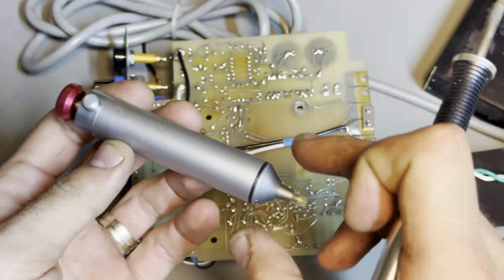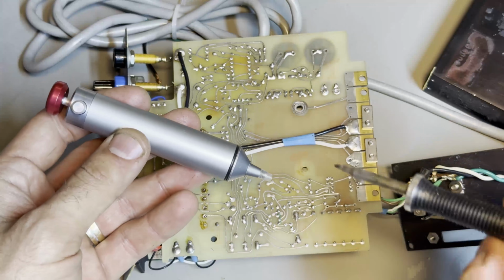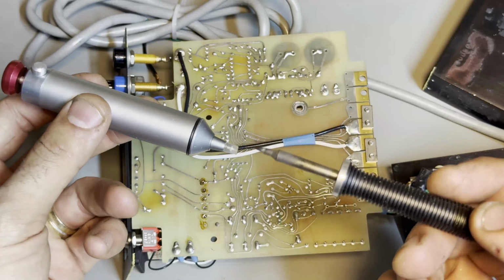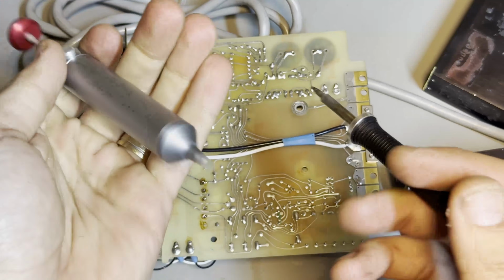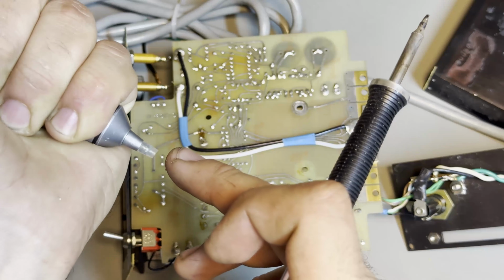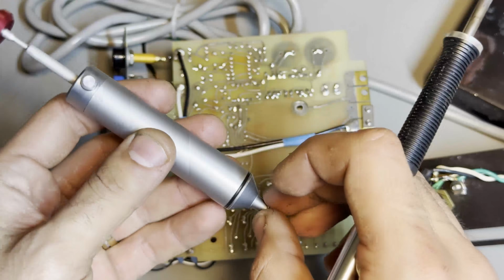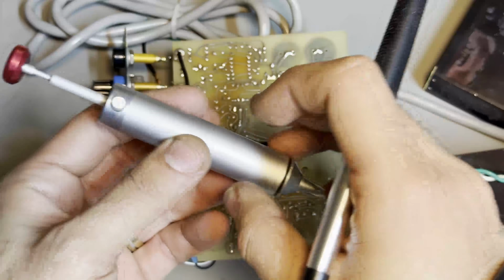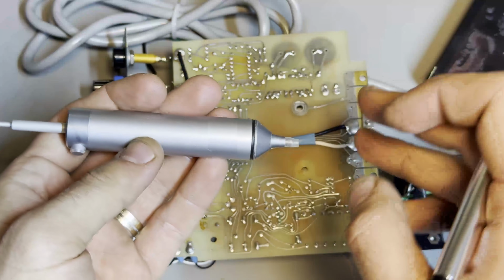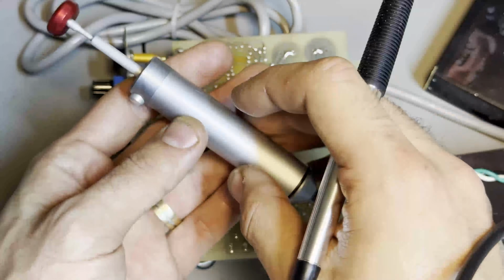One thing you need to be cognizant of is that if you're trying to suck a lot of solder, like one of these patches here, it doesn't really cope well with that. It will clog because the fit between the little plunger inside and the bore is so tight, and any excess solder more than a regular through hole is just gonna block that from exiting, so you won't be able to reset it. It's simple enough to just stick something in there and clean it.